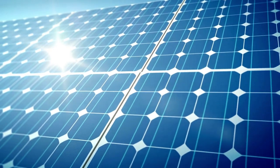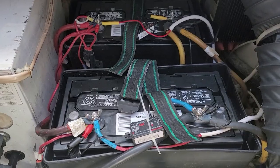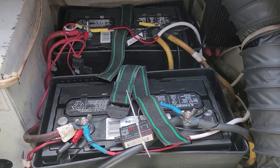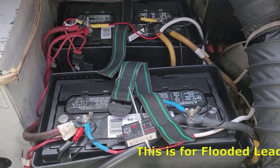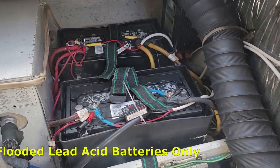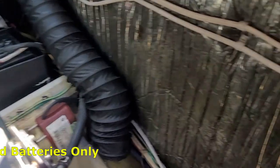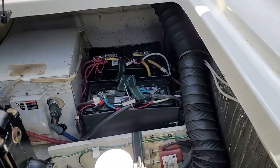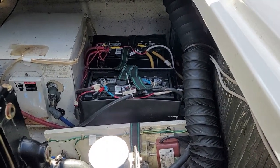So one of the things you have to do if you have a solar panel on your boat charging your batteries all the time — you have to check the water inside each cell to make sure that the water level is at least at the minimum position. That's something really important that everyone should know, and it's the only problem I've had so far.